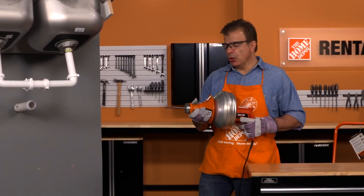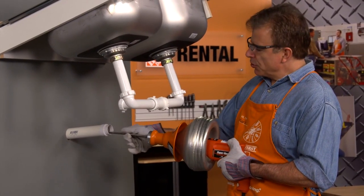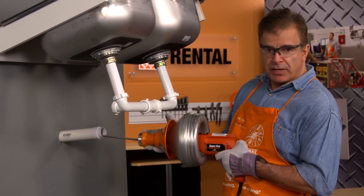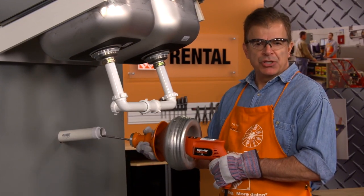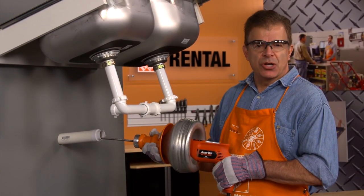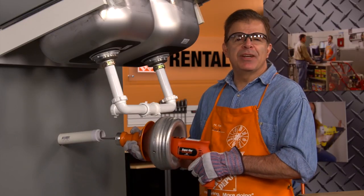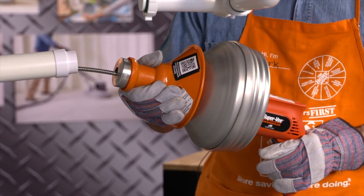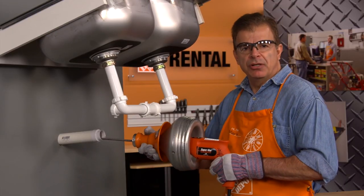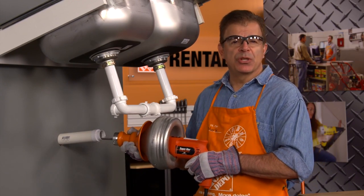When you're ready to start, slide the grip shield forward — this unlocks the cable. Pull the cable out of the drum and push it into the drain until you meet resistance. Leave about six inches of cable between the Super V and the drain opening. Pull back on the grip shield to lock the cable into place. Make sure the switch is in the forward position, then squeeze the trigger slowly to avoid torque buildup. Push the Super V gently forward. When you get to the drain opening, stop. Slide the grip shield forward, then pull a few more inches of cable out of the drum. Pull back on the grip shield and squeeze the trigger, then move the machine toward the drain opening again.